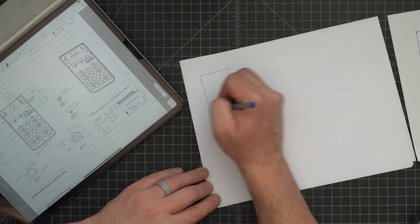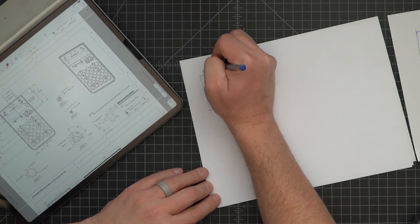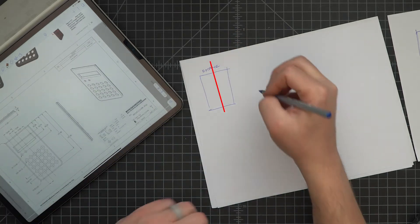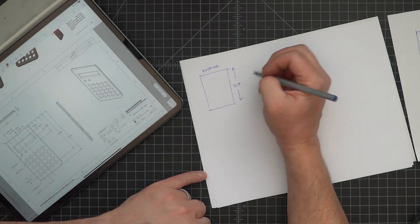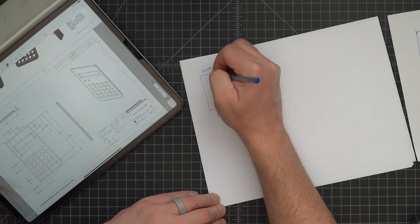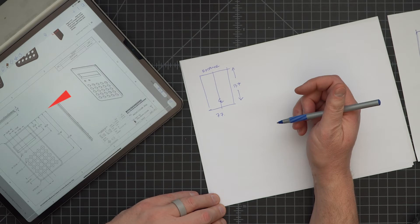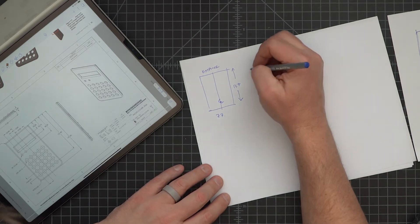With that rough view of my strategy, I jumped one layer deeper into the actions needed to create the solid CAD model. Step one: make a basic extrude based on the overall dimensions — the length, the width, and the height. I put the right plane right down the center of the part and the top plane at the very top of the part to facilitate mirroring across the right plane. Many of the dimensions in the engineering drawing reference the top of the calculator, and since it's better to dimension to a reference plane, I made sure the top plane was right at the top.